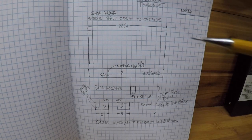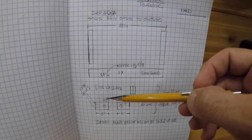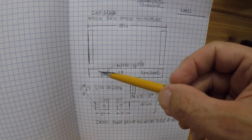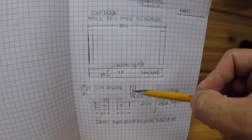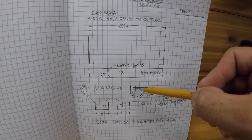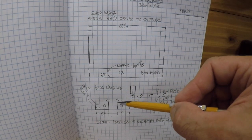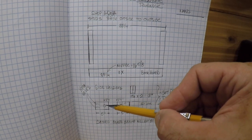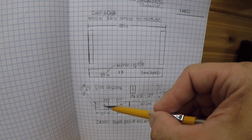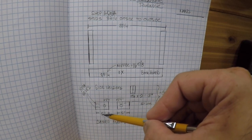All right, so that'll be the center, and the reason I bring up that center is we're going to be making, this will be the sideboards that'll hold the roll in place. Will be two 1-bys together, glued together from a side view. One side I will drill all the way through a 1/2 inch hole, which will hold the pipe coming across. The other side I will drill the hole also, but I will cut it out. So when we're putting the roll up there, the one end will go here, the other part will just set right in here. These will be approximately 5 inches long.